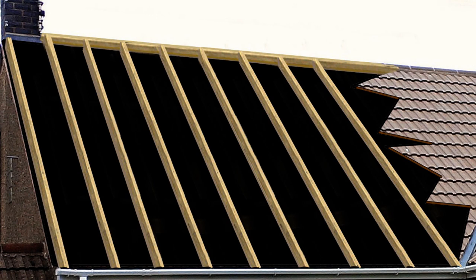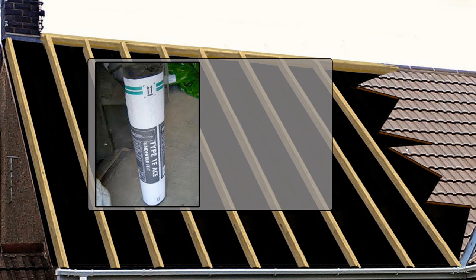Make sure that the roof rafters or trusses are fully clean of any splinters or old nails that may ruin the membrane or undersarking felt going on next. The next step is to roll out your chosen undersarking, starting at the bottom. This can be a traditional reinforced felt — sometimes known as 1F, undertile felt, or underslaters felt — or a newer breathable membrane. I've chosen 1F undertile felt for illustration purposes.